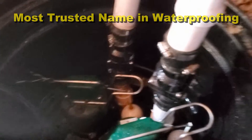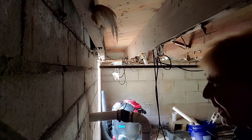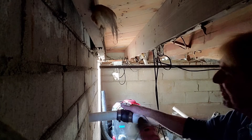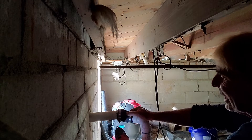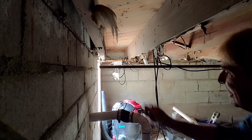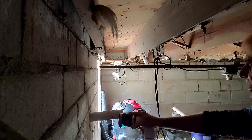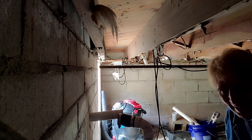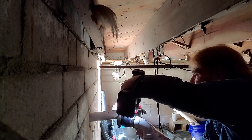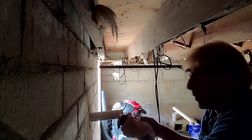What we've got to do is put one inline valve right up at the top and it'll protect both pumps. I'll start by taking off this no-hub — there's going to be water to come back through here. We need to take it off. We're going to take all this apart to replumb the entire project.